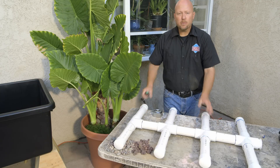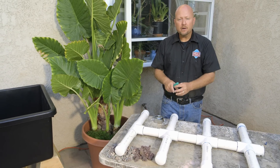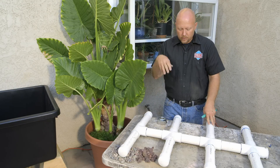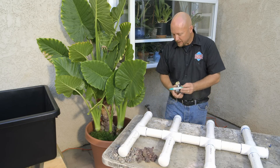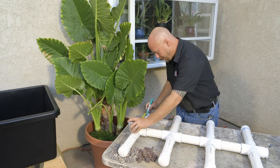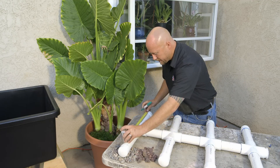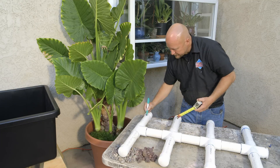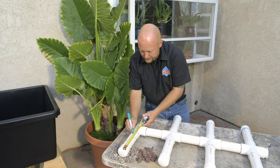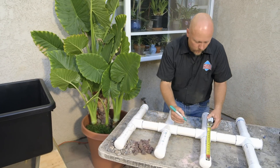Since it's going to be an active bog, we're going to have plants planted on top of the gravel, and the root system is going to work down through there. You'll need to take the time to manage the plants and thin them out on occasion, and not let the roots get bound up in your system. What I'm going to do is put slots about every four inches — that's where I want the water to come through. So I'll cut my slots here and here, go through and mark all this, and then show you how I'm going to score this thing with a skill saw.